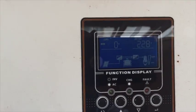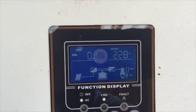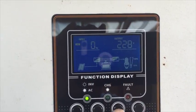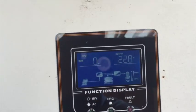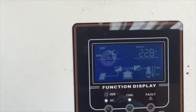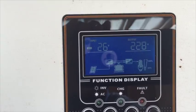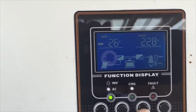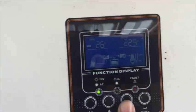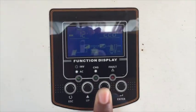That's what you can see on the screen here. These monitors are very inaccurate — I don't think the shunts are calibrated, or they might not even have a shunt in there at all. They might be reading resistance or something. These are very inaccurate as far as the power coming in and going out. I do have an amp meter clamped to the solar side coming in, and I'll have 3–4 amps before the PIP or MPP Solar picks it up. So I do have a DC gauge coming in. I do know I'm wasting a lot of energy on these high-resistance batteries, and I have a set of capacitors on that too.